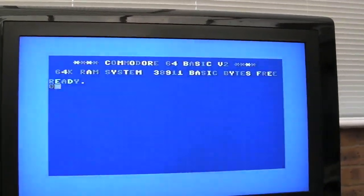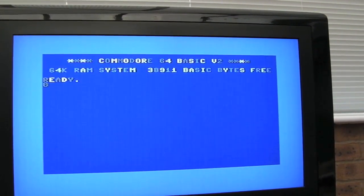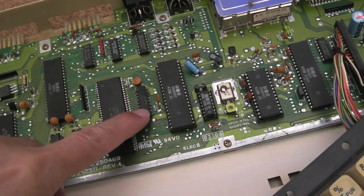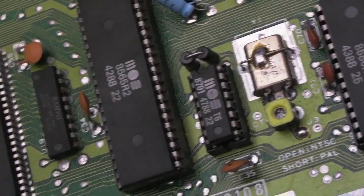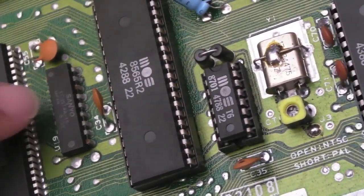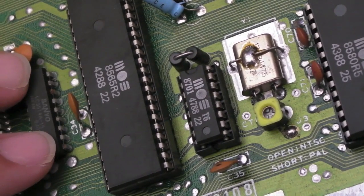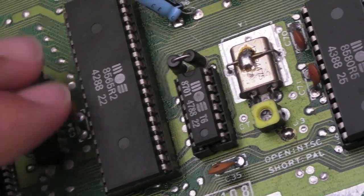But if I just show you what this is doing now, I'll switch this on. This is with a cartridge, trying to boot the diagnostic cart. And you notice the cart didn't boot. Shimmering text - that's typical from what I remember back in the day of being a colour RAM issue. I didn't notice initially, but we've got what looks like a ton of corrosion on here. Rust and some corrosion on those pins. Could be a damaged trace. Or potentially faulty.